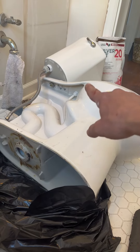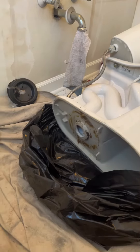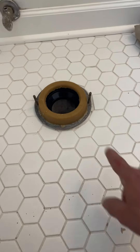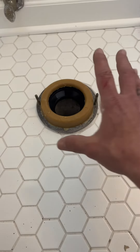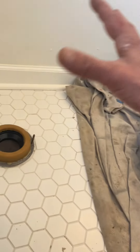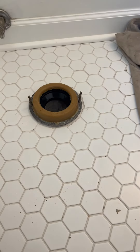Here's our toilet. Normally the tank would not be installed at this point in time, but this is obviously a reset and we're cutting corners a little bit. We've got our reinforced wax ring in place. I've definitely seen them stuck to the toilet and then set on, but sometimes gravity makes them fall off, and this is actually how the instructions say to do it, so it's what we're going to do.